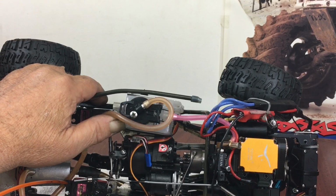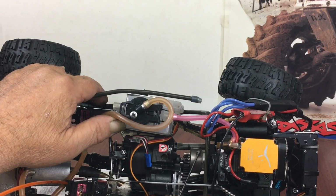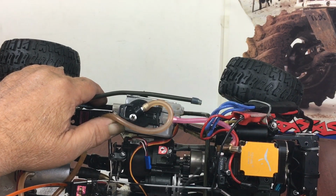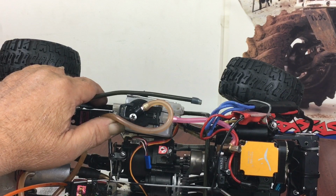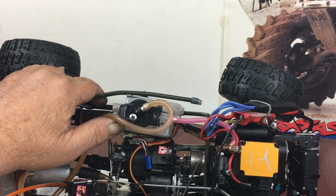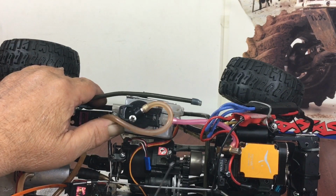So I'm running a 3-shoe RC all-wheel drive nitro clutch in the thing. It's for an 8 scale, and I drilled 2 holes in the flywheel and mounted it to the flywheel clutch that I got from Sterling Engine or Engines DIY. And I had to make that work. I mean, if I had to do it again, I'd probably just order one of their 2-pin clutches and try that.